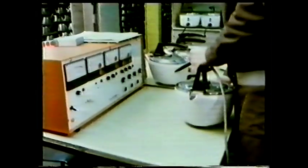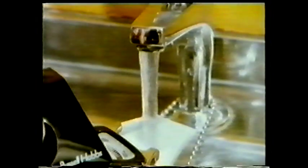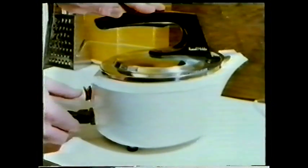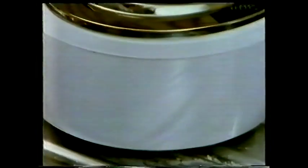After every conceivable laboratory test had been done, the kettles were sent out for the most critical testing of all — everyday use in a score of homes. These field trials are crucial. Consumers are notoriously all thumbs, and if there are any faults, they'll soon show up in the kitchen. Real people spill things on their kettles — boiling fat, bleach, food — and then wipe them clean with dirty cloths. Fats and oils can weaken and discolour some plastics, and that's exactly what happened: the kettles began to turn yellow and started cracking.